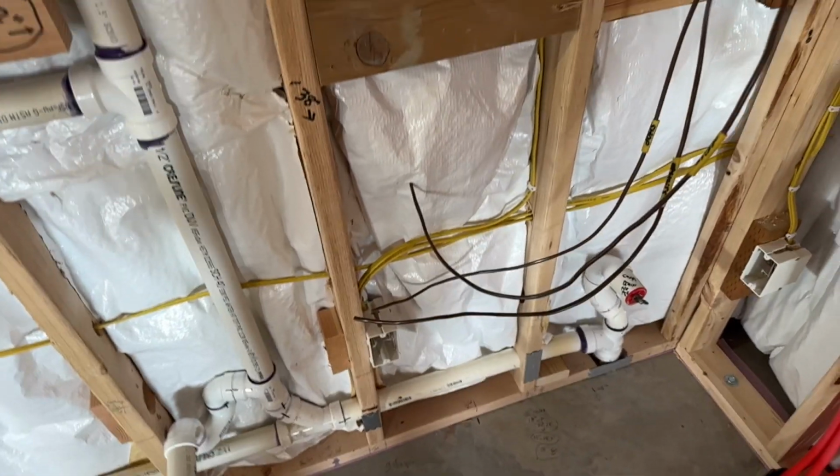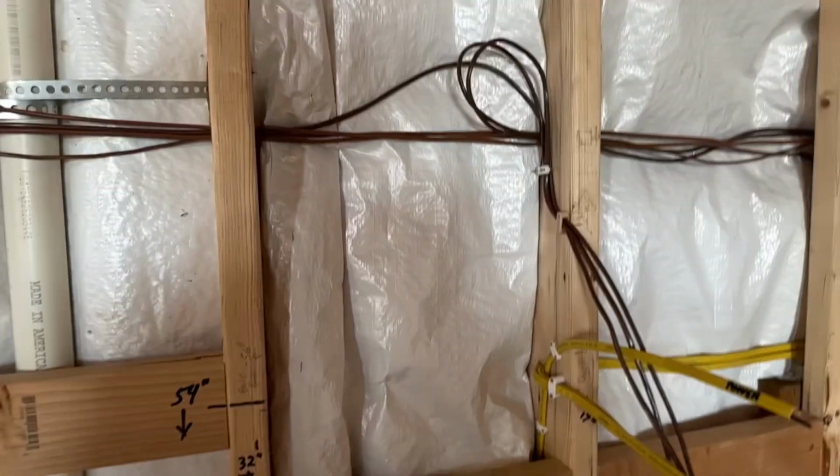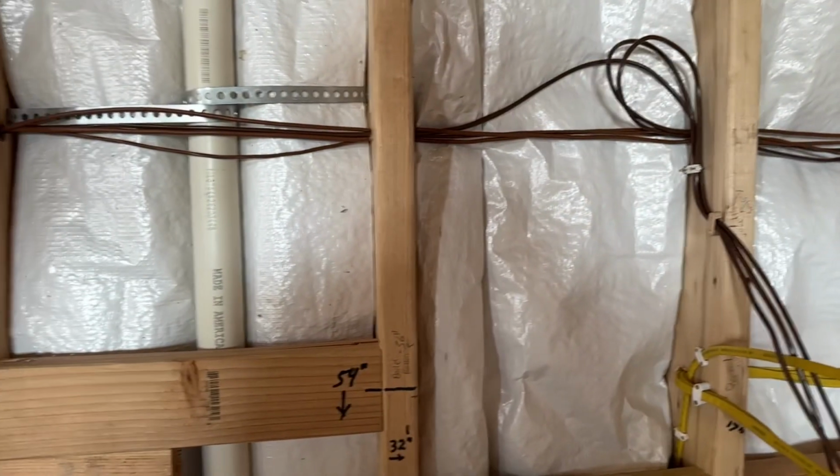But those are tricks that I've learned to help your rough-in stage. Another thing that people frequently forget is thermostat wire. Wherever you're putting your furnace, whether it's HVAC or a boiler or whatever it may be, you need to have control for it so you can turn it on and off. So I plan on doing 3 zones in this shop, even though right out of the gate I'm just going to be doing 1. I am roughing in for 3 because I always rough in for futures.